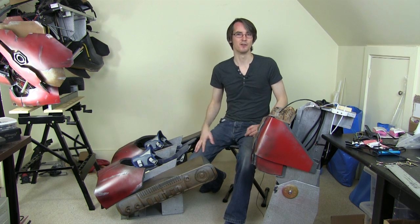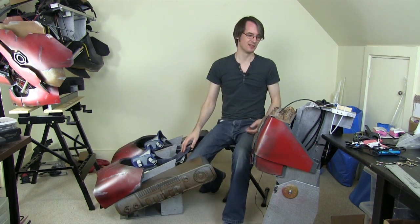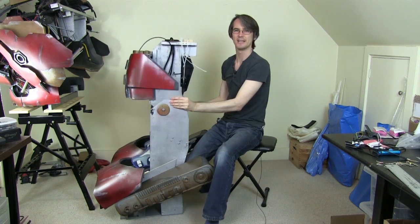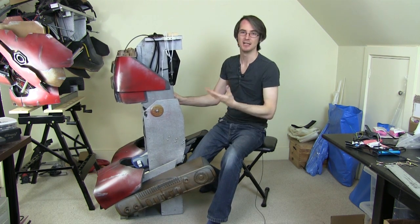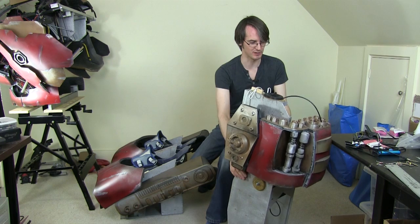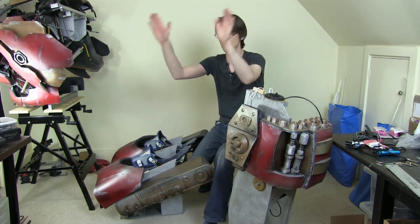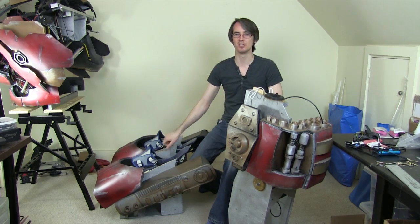The basic frame was one of the first things I designed and built, and I'm quite glad that my pivoting ankle idea is actually of some use in the end. But what I really need to do is somehow reattach these pieces with a hinge — one that moves backwards and forwards and also moves left and right, and can be locked up so I can put the suit down and leave it standing. It's also got to be really secure. Having it pivot at the ankles when it's not supposed to will result in the entire suit falling flat onto people, which will be really bad. So we need to make something extremely secure for this mechanism.